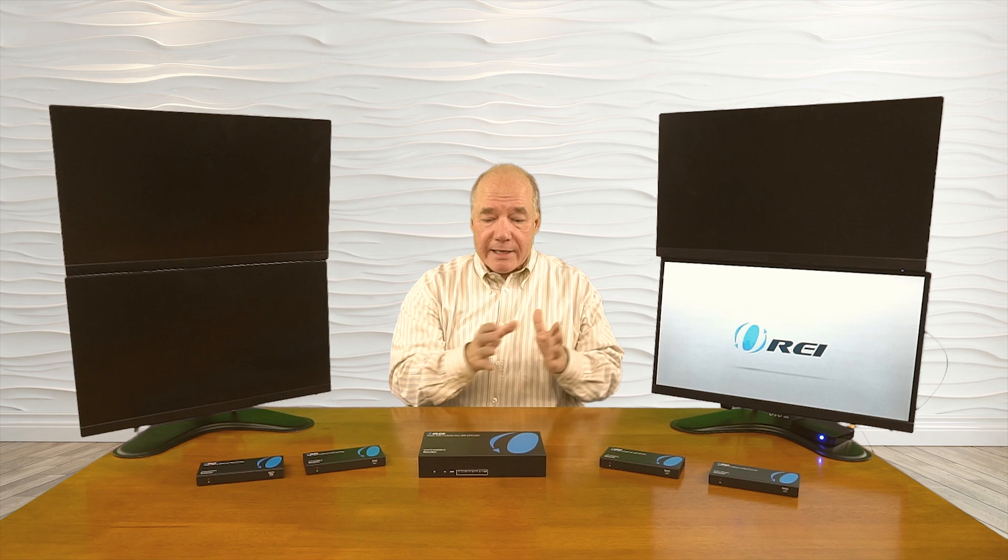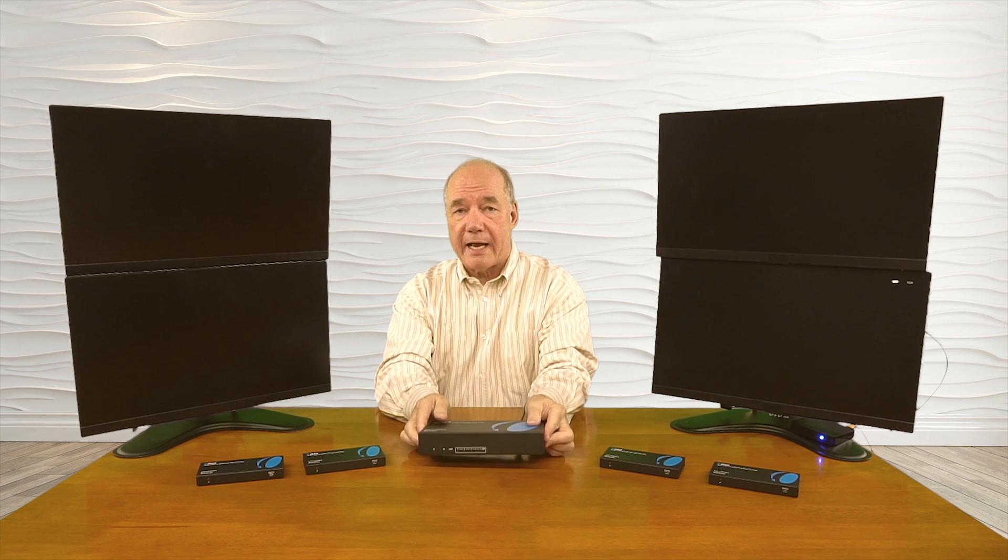Now I'll show you the connections you'll need to make to use the HDMI splitter and extender kit with your own equipment. For this demonstration, I've set up four monitors to simulate the four remote locations. Over here I have a small media player connected to a bottom monitor that's currently looping a video I'll use as the content to distribute to those remote locations. In front of me I have the sender module and four receiver modules. I'll start with the media content — I'll disconnect it from the bottom monitor and connect it to the HDMI input port on the back of the sender module.